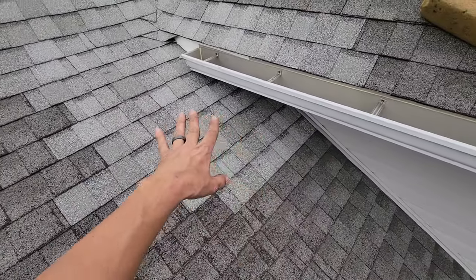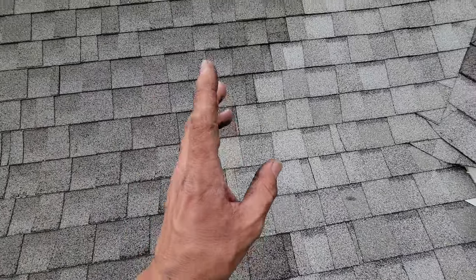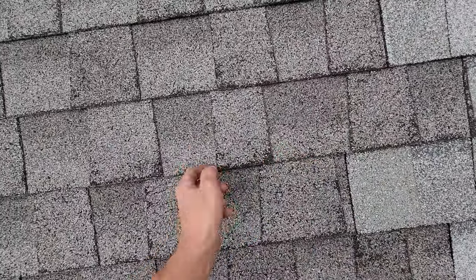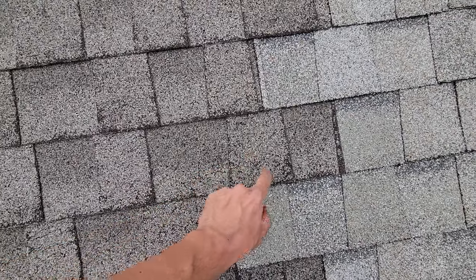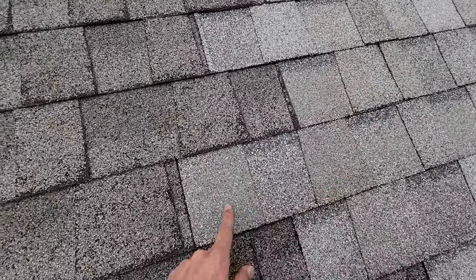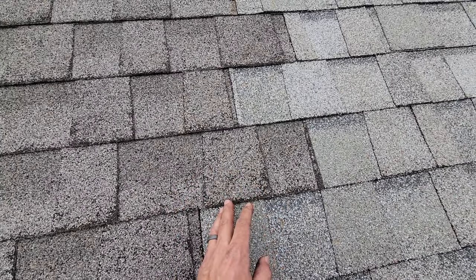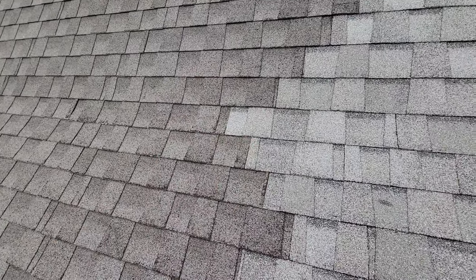Once the decking's done, when I do repair work I usually use ice and water to lap over. It's important to lap over your work. As you're coming up, make sure your patterns are offset far enough — some of them I had to trim because the roofer did not offset them far enough. Make sure if you split this portion over a little bit to get this in and flat-bar everything, you put a couple dabs of sealer because your old shingles are never going to stick down here. The new shingle has a bottom seal so it's all going to stick. However, the old one — whether it's top seal, bottom seal, whatever — it's old, it's dry, it's never going to reseal. If you don't put a couple dabs to seal it, it will eventually flap in the wind, blow loose, and crease.